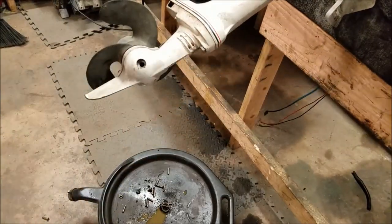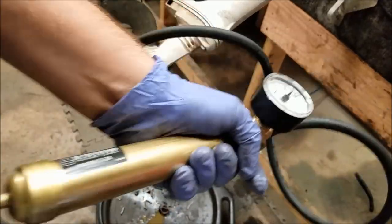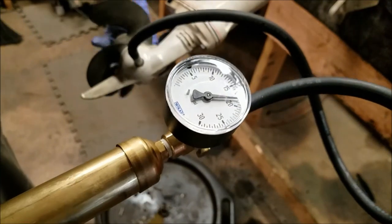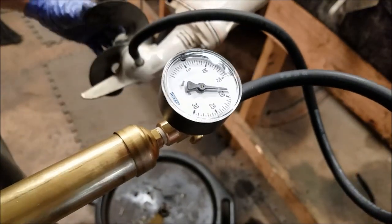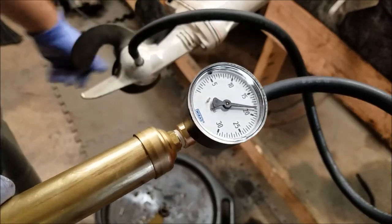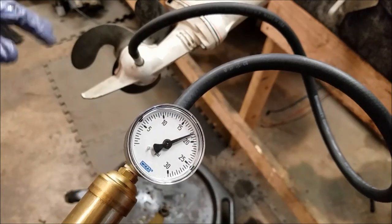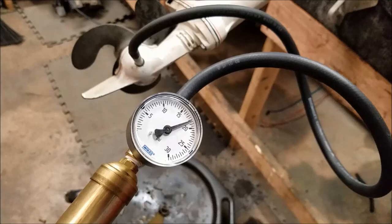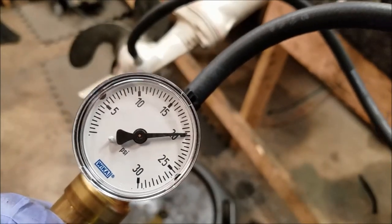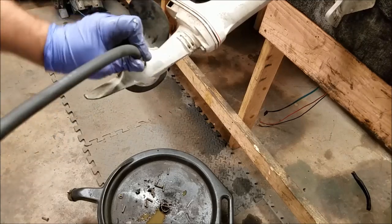Here's a full picture of what the pressure tester looks like. In theory you just kind of wait for it to leak out. Well, it's not leaking. I don't have the vacuum test type of pump, but the oil was milky and old — seems like it's holding now. It's supposed to get to about 15 PSI; see where it goes. It's holding 20. Probably fine. So let's not rebuild the lower unit — not anytime soon anyway.